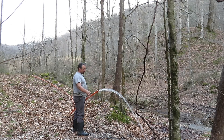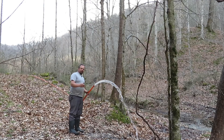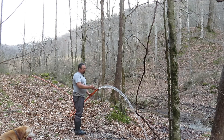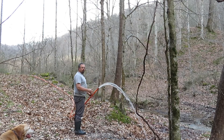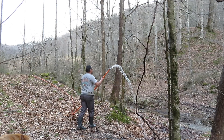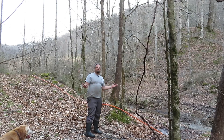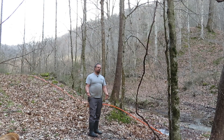That's a lot of water. Now with this much water — well, not this much — this would work for a turbine, which I will probably also do. But as far as a water wheel, this won't work; this is not enough. You've got the pressure but you don't have the volume. Now we will have the volume with a bigger pipe, or a raceway or a waterway — I don't know which one I'm going to use yet. So with that much of a fall and this much potential, I think we will have no problem turning that alternator.